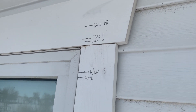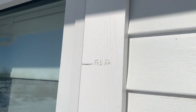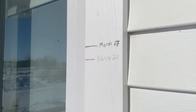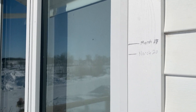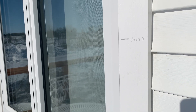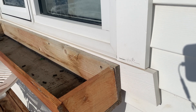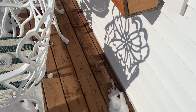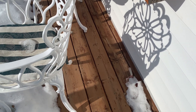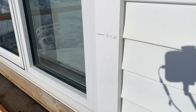As the days get longer from there, we have February 1st — still getting full sun in my glazing. February 22nd, getting almost full glazing. All the way into March, getting partial sun because the days are getting warmer. April, it's getting pretty nice outside, getting about half the sun in the house. By May 15th the window is completely shaded, and in the summertime the sun is all the way at the bottom of my house, not even touching my siding. Then the summer solstice — and back to the winter solstice.